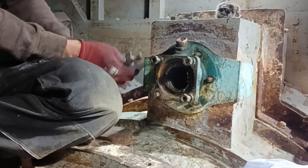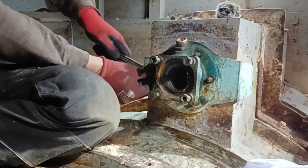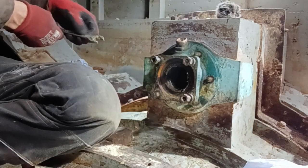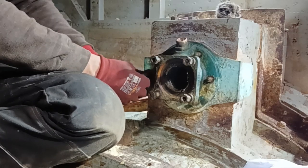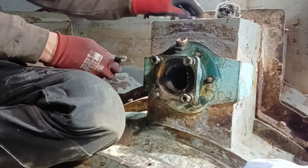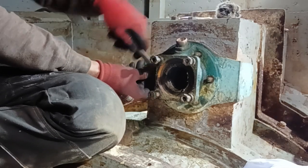And we have to have a look for that grub screw. It would be top dead center, as usual. Well, you have to look for that, because if you don't, you'll never get it out. Never, never, never. I think I might need a smaller spanner than the 3/4. That's right. Now, for some reason, they use two sizes of nuts, but only on two. And the same with that flange as well. Why that is, I don't know, but it is what it is.